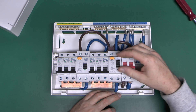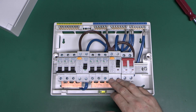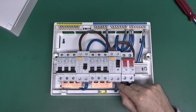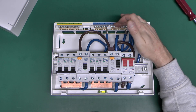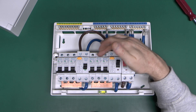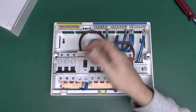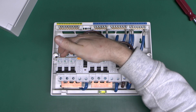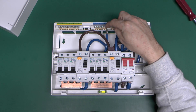Assuming the RCD has been switched on, the line and neutral will continue through the RCD and come out at the bottom. The line comes out on this copper bar, which in this case goes into the three circuit breakers here. The neutral comes out at the bottom of here and actually goes up to this bar here - this is where you connect your neutrals from the circuit wiring. The lines will connect to the top of the circuit breakers here. And it's exactly the same thing with the set over this side - your power's coming in at the top, the line comes out on the bar here, goes into the bottom of the circuit breakers, the circuits are connected at the top, and the neutral for this one comes out at the bottom there and ends up on this bar over here.